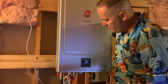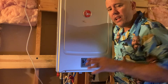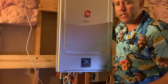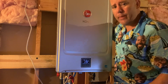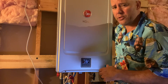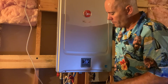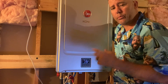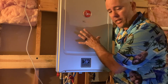So if you get an alarm, you don't have hot water, and you've got power to the interface — go ahead and check it, notate any current alarms, clear them, get the water heater working, use it, and then call tech support, your plumber, or your technician later. Get somebody cleaned up, get to work, get to school, do that, and come back and address it. If you're getting a 6.1 or a 6.3 and you clear it and it doesn't come back, don't worry about it. I've had several where clearing the alarms — basically a reboot — fixed it permanently. If it's not a persistent alarm, let it go; if it becomes a problem, we'll troubleshoot it. In the next video we're going to do troubleshooting on different codes — 6.1, 6.3, no power to interface — so stay tuned for those.